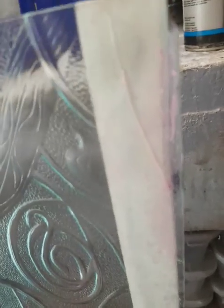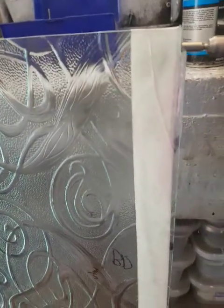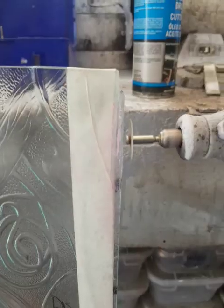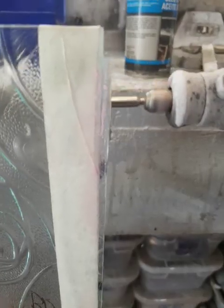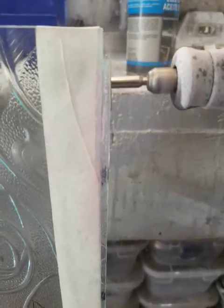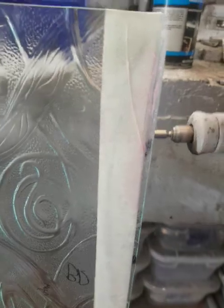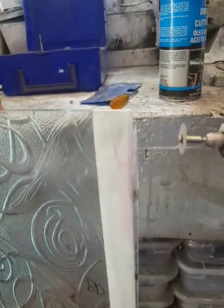So you can see I've got a cut through. Cut from behind. Or you can go down the side and file - it's actually quite fast. That's about two millimetres thick now. The reason I'm doing it from the back is because it keeps the diamond dust away from my face and the air a bit cleaner - it's going to be easier to clean up. I'm going to need to wet this again because it's gone dry.